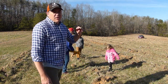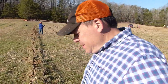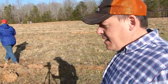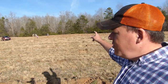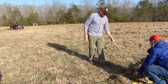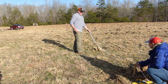Stacy's going to stay on this end. I'm going to run down to the other end and adjust that post so that the hypotenuse is shorter on our triangle. That measured out to 200 feet, so just to double-check, we're going to verify the measurement down this one side — that was supposed to be 160. We're going to see now from our new post to our corner spot that that's 160 — everything's right where we want it to be. We've got a little bit of extra here, so we're going to move that corner post again, just about a foot or so that way. Pull this tight on the other end and then double-check the 200.